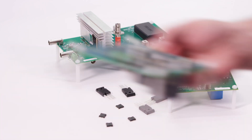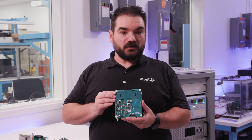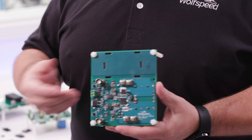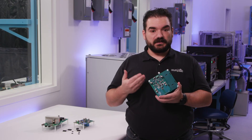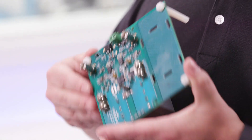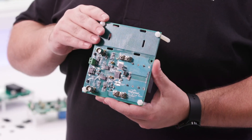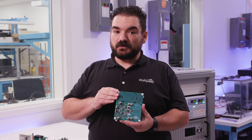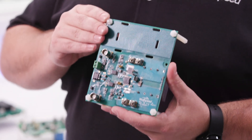Historically, we've had dedicated boards for dedicated package types. This made it difficult to compare apples to apples between different types of packages because the boards could be slightly different — they could have different gate drivers or different variations. This here is for our TO leadless package. If you wanted to test the dynamic characteristics of a different MOSFET even in this package, you would have to desolder the package, swap on a new component, and test. With something like this surface mount MOSFET on heavy 4-ounce copper for power, it could be very difficult to desolder it without damaging the board. This made direct part comparisons very challenging.